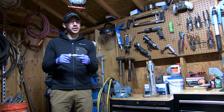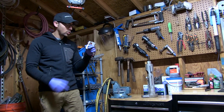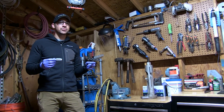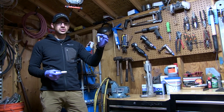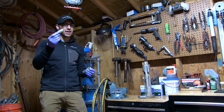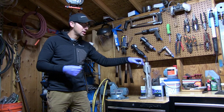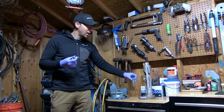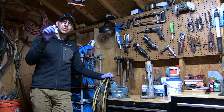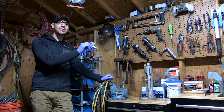This one is a reusable fitting, happens to be about $20-$25, sometimes even $30-$35 depending on where you're buying it from. Why would someone pay this much money for a fitting? The reason is because it's reusable. You could use a swedge fitting which happens to be like $4-$5, but you need to spend $500-$600 on a swedge tool machine to put that on. So if you're not really dealing with a lot of fittings or a lot of hydraulics, maybe it pays to have someone put it on, or maybe it pays to get reusable fittings. For this type of fitting you don't need that machine — spend more money on the fitting but save a lot of money on not buying that machine.